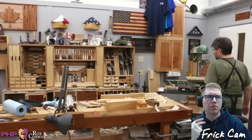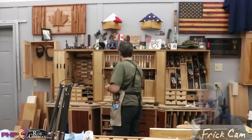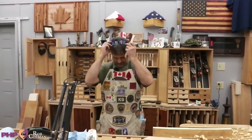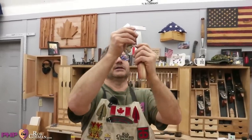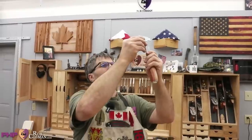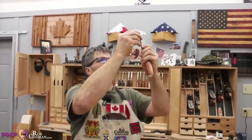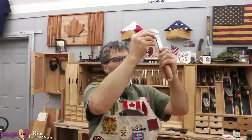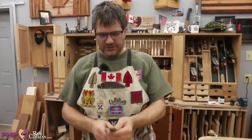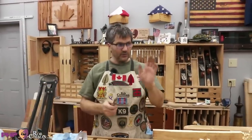Well, you just hold your square up to it, right? You take your square, you hold it on the side and you get up to the light and you look. Mine's out a little bit, not a lot. I couldn't see it with the naked eye. If I wanted to fix it, then I go over to the grinder.